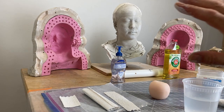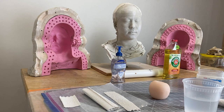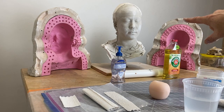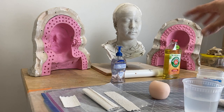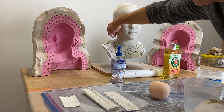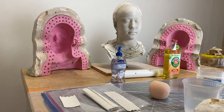Mold making is a process that involves figuring out how to divide a form up into parts in order to create a form that you can pour into, that can separate into multiple parts. There are many different techniques for doing this. In the background is a life cast — half of it was made with alginate and plaster bandage, and the back half was made with just plaster bandage. The head was divided up along the ear, over to the other ear, around and along the shoulder, so the front part came off and the back part comes off afterwards.